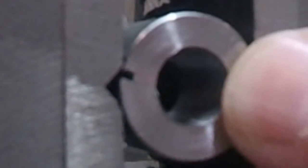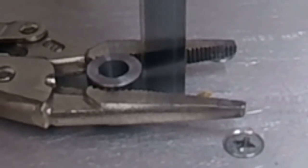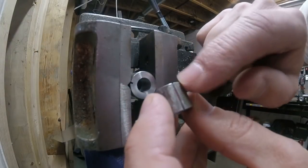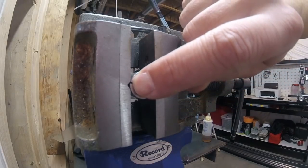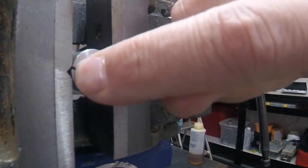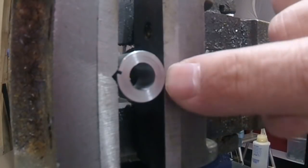If you can see right there, there's a little tiny V-notch in this vise to help you hold things like this. And then I went over to the bandsaw and I put just a little slit on the side of this collar, which isn't going to hurt anything because it's just going to get welded over when I put it in the caliper bracket. But if you take that little edge and line it up on one of the edges of the V-notch, then when you tighten the vise down, it essentially bites into that little notch and holds this without it spinning,